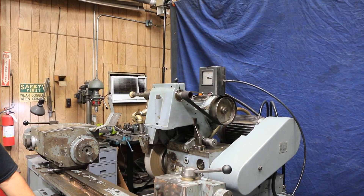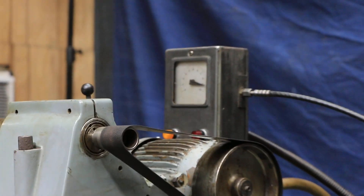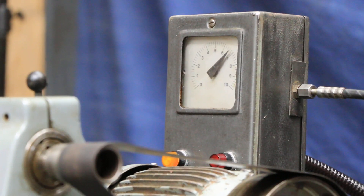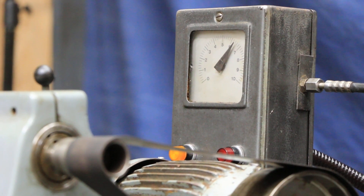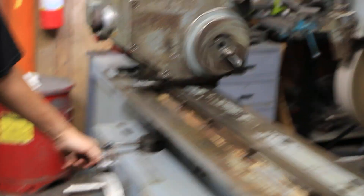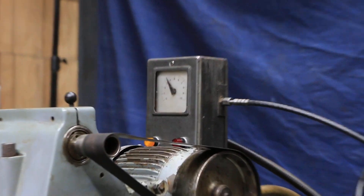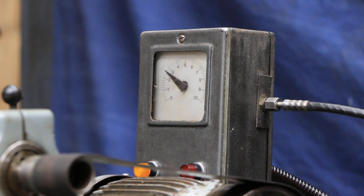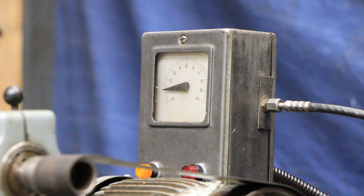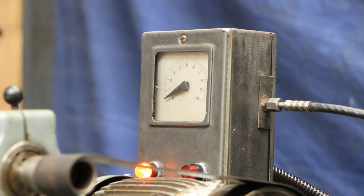So we'll show you that again. We come in with the slide, start our work head, and start our feed. That feed is adjusted from over here — I can stop it or increase it. You would be actually grinding right now. When it gets down a little past the one, it's going to go from the coarse feed to the fine feed. Now we're in the fine feed, and you set that with the next knob over here on the front to get the feed that you want.